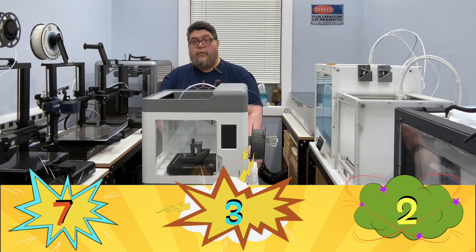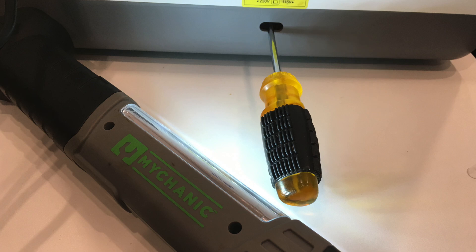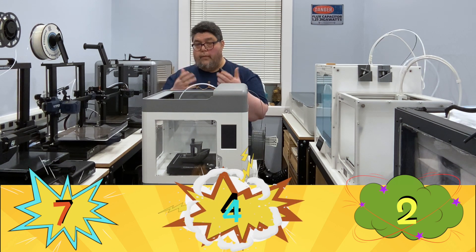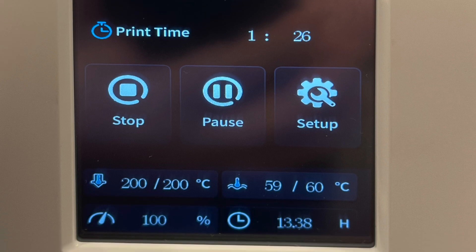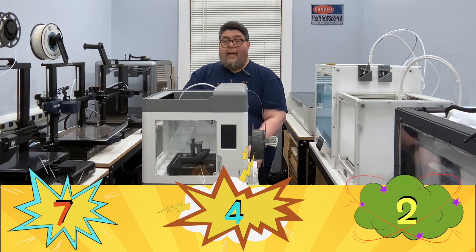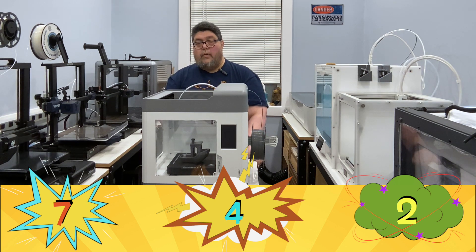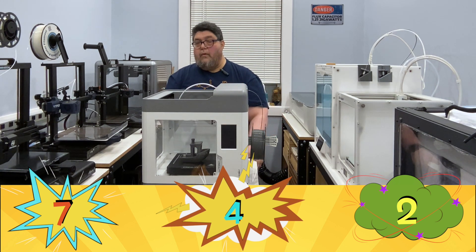As with most electronics, the Surmoon V1 Pro ships with a power supply that lets you switch between 110 volts or 220 volts. Here in the US, the right choice is 110, but my unit shipped set for 220. Normally that's not really a problem, but the actual switch for the Surmoon is located deep inside the case itself. You can't see inside to place your screwdriver because the access hole is quite tiny. I eventually did get in there and was able to toggle the voltage, but it was an unnecessary pain that earns the Surmoon another weird point. The control console is nicely embedded in the chassis, but you can have only 20 models on any given SD card — no folders, nothing. We set up a model we print a lot and it has more than 20 components. Even though the models used way less than 1% of the card's capacity, I had to switch to a second card. That's a 'what were they thinking' weird rating.